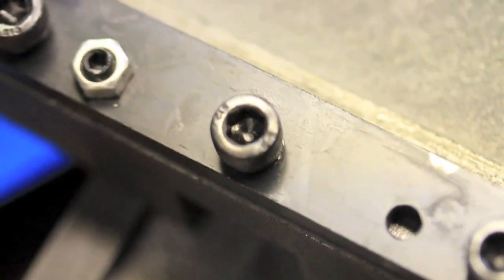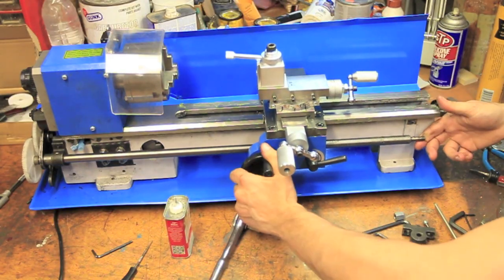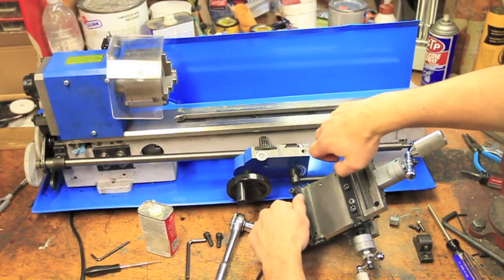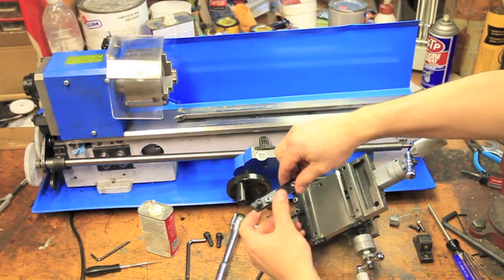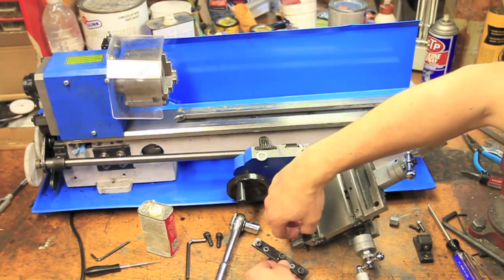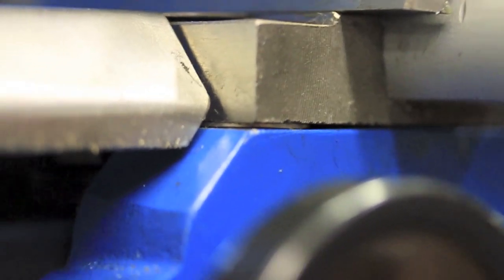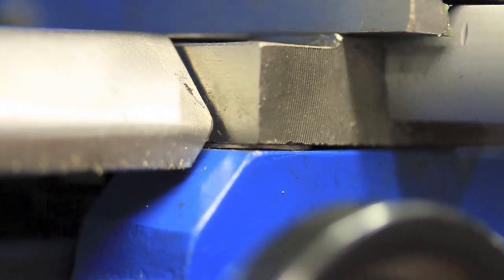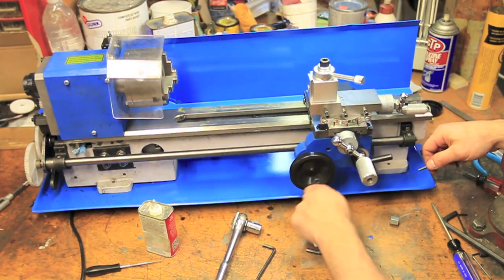At first, I thought it had vibrated out and was lost, but then found out it was intentionally missing because it interferes with the pinion side of the carriage gear. These clamps leave a lot to be desired in adjustability, smoothness, and rigidity, so an upcoming project will definitely be to redesign them. I also had to add a thin washer to separate and increase the space between the pinion gear and the rack gear so it would turn much smoother.